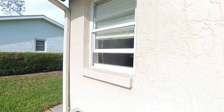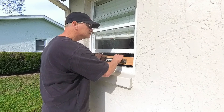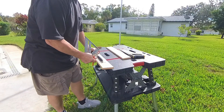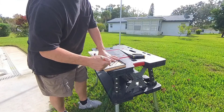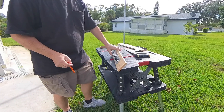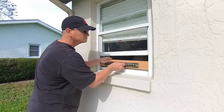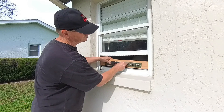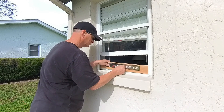Take your time and make sure this is a nice straight cut. You want it to fit flush against that window track on the inside. Let's test one final time for fit. It didn't fit, and that's a good thing because we'd rather it be too large than too small. I draw a line right where it's interfering with the track and do one final cut. For that final cut, you may have a hard time getting your square in place because it's hitting the connector, so just put another piece of wood on the top side to give you room to get away from the connectors. This time it should fit — and into the left track, past the right track, it fits. Here I realize I need to scab a piece on the bottom because my connectors are hitting the inside track, so I go ahead and make that adjustment.